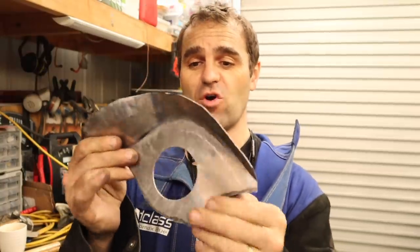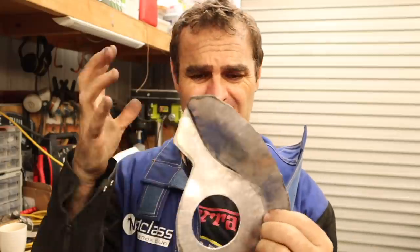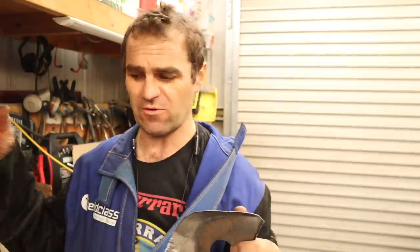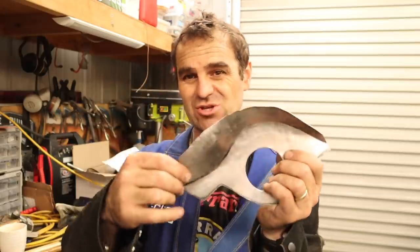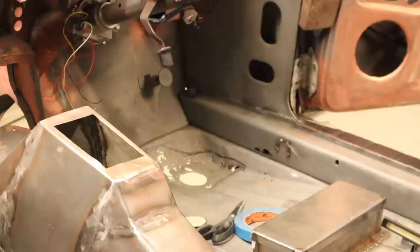All right, so again, same as I did on this side. I've gone through, I've punched my hole, I made my shape, I bent a little bit of a seam, and this is where my microphone battery went flat. But as you can see, once I got the seam in it, I actually got myself some of these sandbags, and using the sandbags and the plastic mallets that come with it, this is my first time using them, but I might go into a bit more detail about the sandbags in a future episode. So I started beating out the shape and stretching the metal to try and get these extreme curves that I need to match in with the body. And I used a bit of the shrinker stretcher as well. So let's go and see how it fits and see if we can put it in the car.